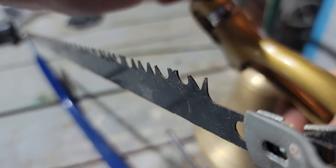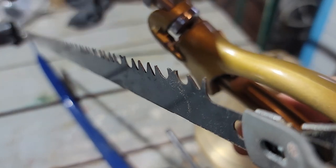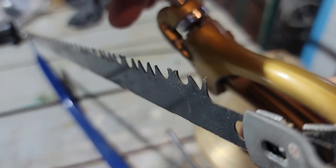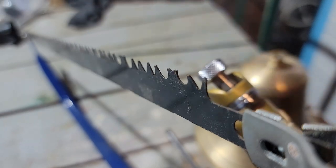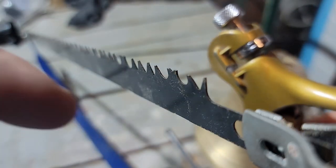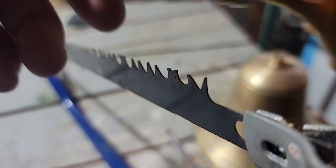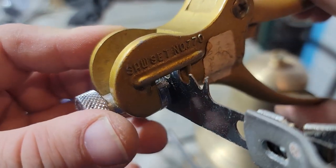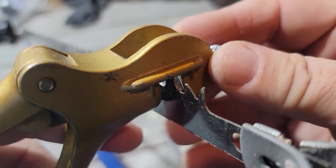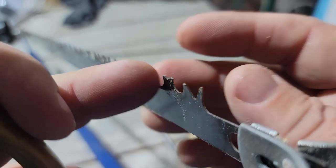How the tooth-setting tool works: you clamp down, then you can either tighten or loosen the end. By clamping down this angled piece, it won't move, then you tighten it back down. If you look closely, you can see size markings all the way around so you can set exactly how much offset you want. To use it, line it up with your teeth, give it a squeeze, and change sides on the next tooth.